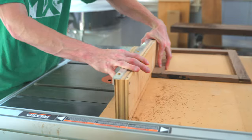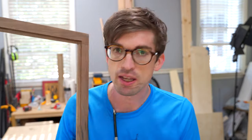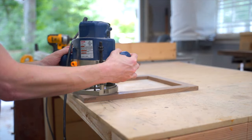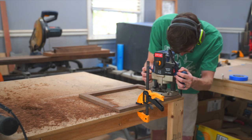I'm going to use a piece of cardboard from the piece of glass we're going to put in, just as my backer, and I'm testing this out. I needed to make a rabbet. If you are doing a miter, you can actually do these rabbets before you glue it together, but since I did not do a miter joint, if I did the rabbet before gluing everything together, you would actually see it coming out the ends. So instead, I'm just using my router with a rabbet bit and coming through and knocking this out.